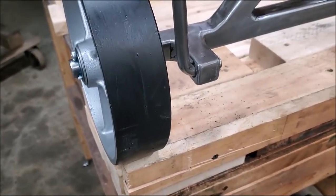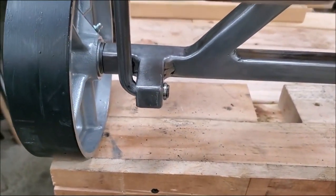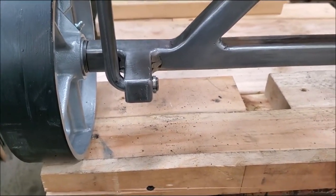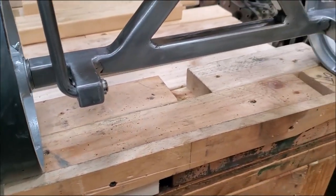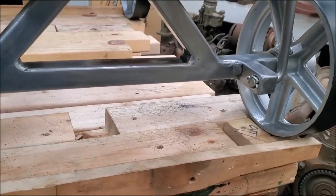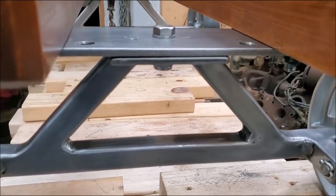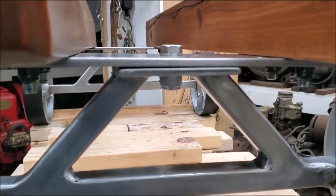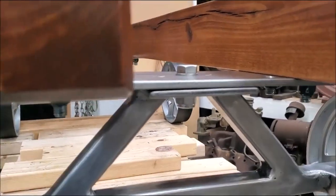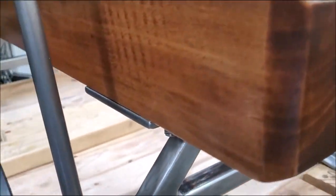Cotter washer, cast iron wheel, grease fitting, roller bearing, 1/2-inch handle, and 1/8 square standoff, 1/8 square tube, 11 gauge for the main frame. Cotters installed. Pivot, 1/2-inch bolt, shoulder tap for the alignment. I think them's 3/8 bolts going through the metal part.